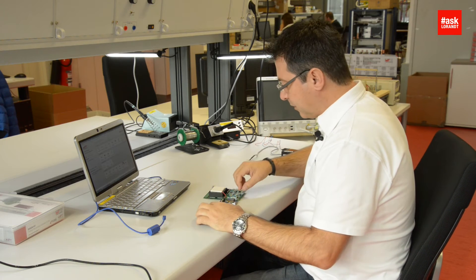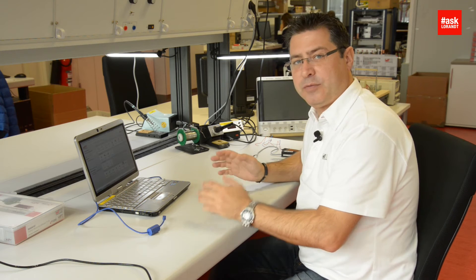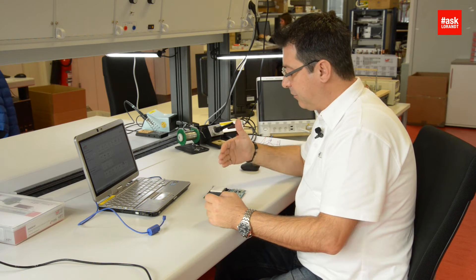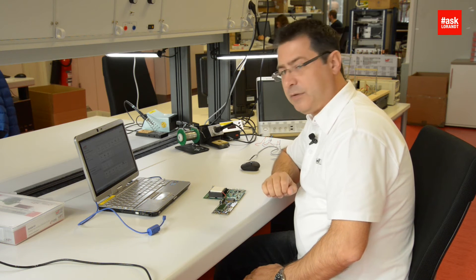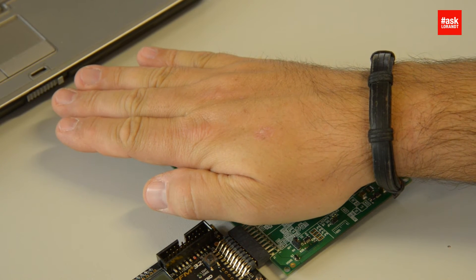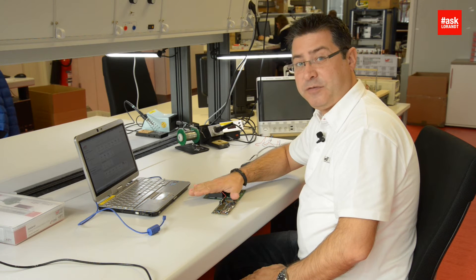The next step is I will move the jumper from the solar cell to the thermoelectric generator. You can see on the power board — the power board comes from Linear Technology. The processor board comes from Silicon Labs; it's a Giant Gecko 32-bit 50MHz processor, and the power board has different harvesters already. To empty the capacitors, I recommend pressing reset a few times. Now I will put my hand above this thermoelectric generator and just from my body heat — my 37 degrees Celsius — it will start to operate this processor at 50MHz.